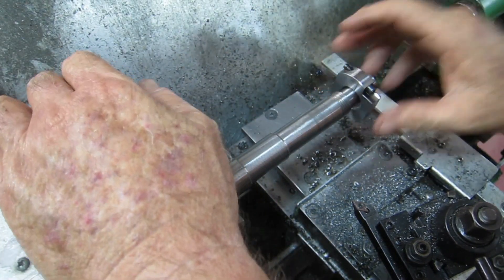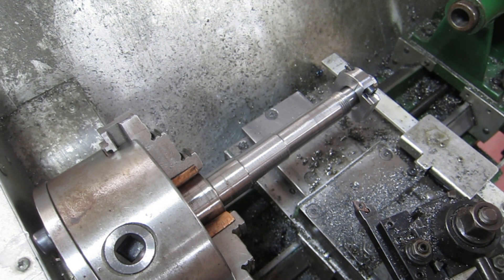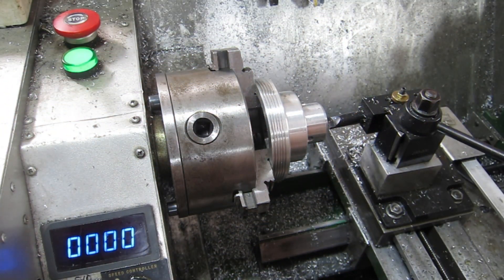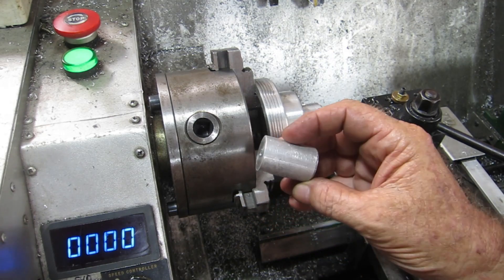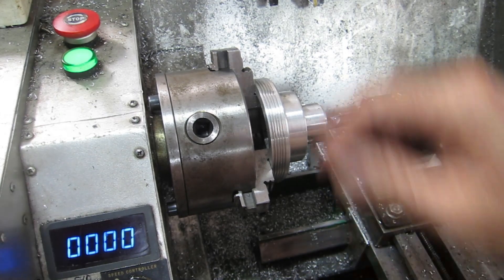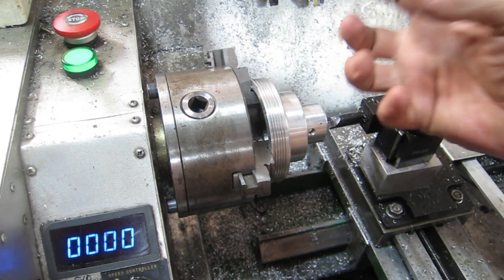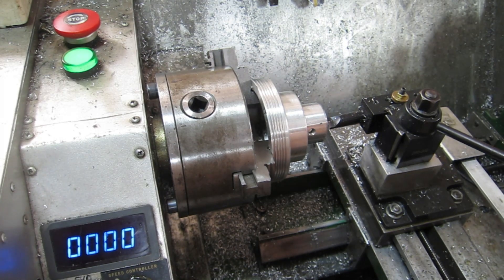Alright, so that's the state of affairs. Next cab off the rank will be to modify that pulley as a side project. So I've bored most of this out - about half a millimeter off where I need to be. I've decided not to turn this down at all, I've just roughed it up a little bit. I'm going to put some Loctite on it, push it in there, and drill three new holes through this once it's in there so the grub screws will make sure it stays in place. This should be the last pass - if I take another 0.25 cut it'll probably be too much, so maybe I'll go 0.2.